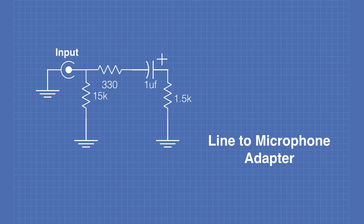Finally I've got a 1.5K resistor from the output of the capacitor down to ground. This was very important — sort of the missing component — because without it I would get a popping noise. What it does is provide a constant impedance for the microphone input, and then that goes to the output which connects to the microphone input.